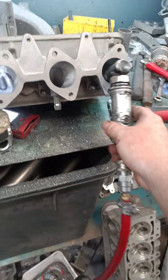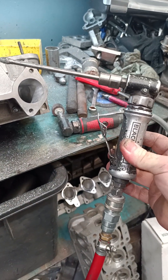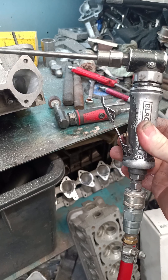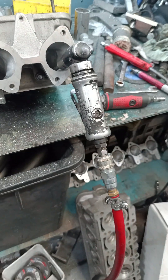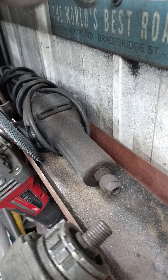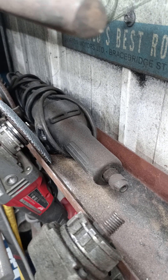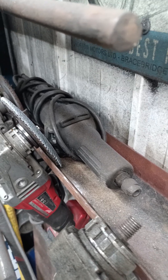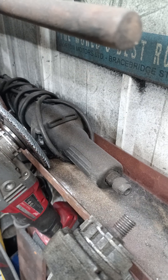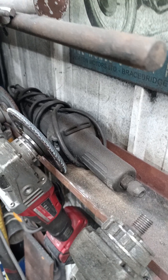Some calipers, a few other little things — but definitely if you're going to start, right angle die grinder is the way to go, you'll just be able to handle it better. It's just easier, it feels good in the hand. Now I have a good quality electric die grinder but I don't even use it. I've used it a lot and it's still got a lot of life left in it. It just doesn't have the speed control that the air powered one has, and I have a really, really big compressor.